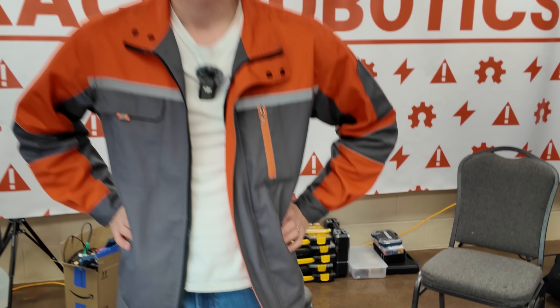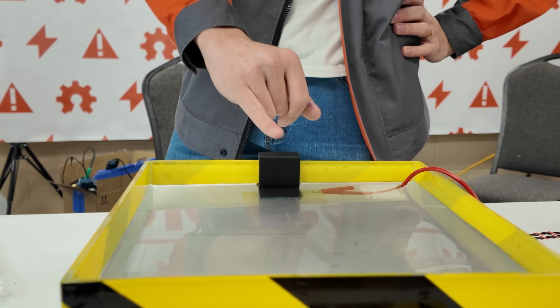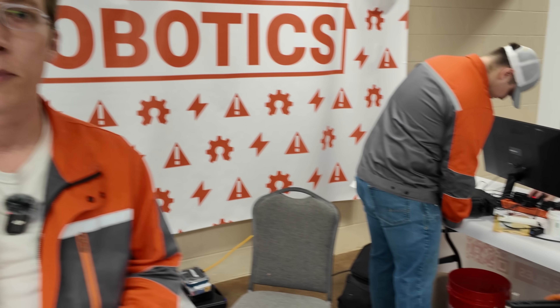The speed depends on the material. For a 0.6 millimeter plate from the PowerCore V1 Kickstarter, cutting with the 1.5 millimeter brass rod is relatively slow. But cutting with the 0.3 millimeter brass wire, we've gotten up to 100 millimeters per minute in that material. For 3 millimeter aluminum, we've gotten up to 20 millimeters per minute linear speed with the 0.3 millimeter brass. There's a lot of factors: material type, thickness, dielectric, flushing, and wire diameter. Three millimeter steel is about four and a half times slower than aluminum, while 3 millimeter titanium is only about two to two and a half times slower.